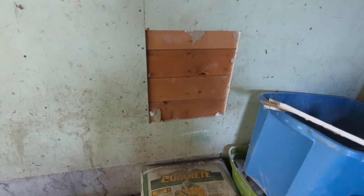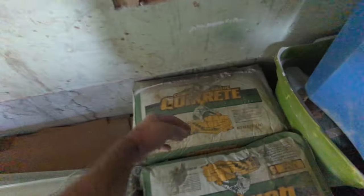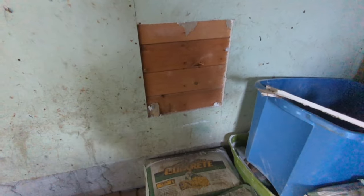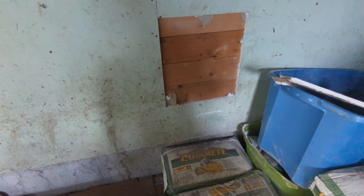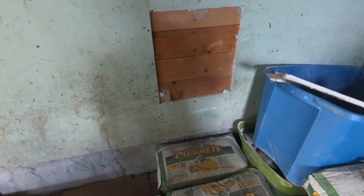So I'm going to do the same over on the other side. And we've got to go lower because the drywall hangs down over the rim out here. So we're probably going to end up squaring this down, going over and squaring that down, and just coming back with a, because this is, happily, not like plaster or anything of a unique width. We'll just put a new square drywall on the wall right there, and call it quits on that for now. More importantly, we'll get the sink plumbed correctly.